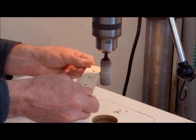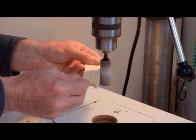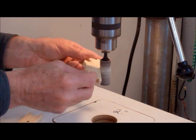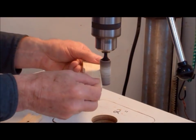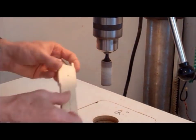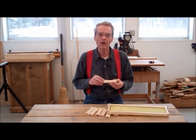Finally, it is time to clean up any rough edges. A drum sander attached to a drill press makes short work of this step, but hand sanding works too. When sanding, inspect each sidebar and reject any that don't fit the spec. If you are like me, there will undoubtedly be a few.